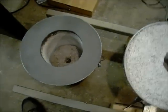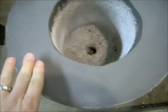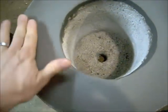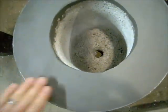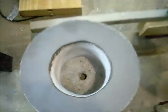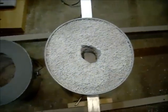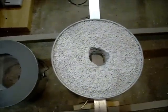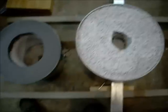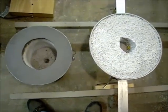I don't want to gas up my whole basement — that's probably not good for me. This is drying up a little bit slow; I imagine it'll take a while to dry all that out. I don't want to get it too hot while it's drying. After that we'll go ahead and line this and line the base, and I think after that we'll be ready for our burn. I still have to line the whole top of this and build the burner, so I'm working on that.